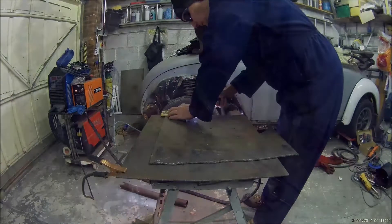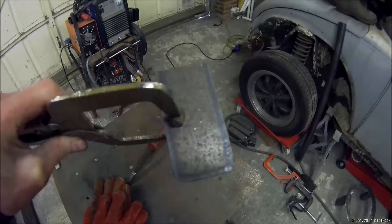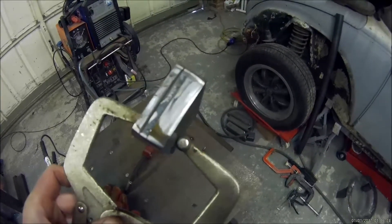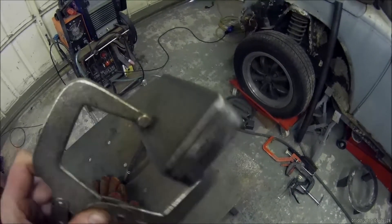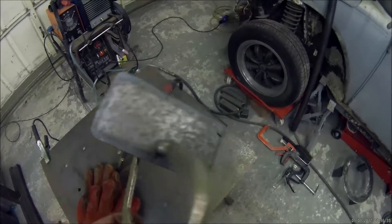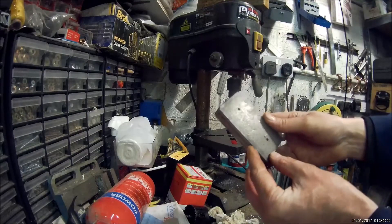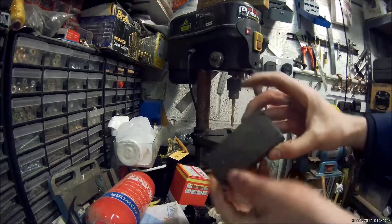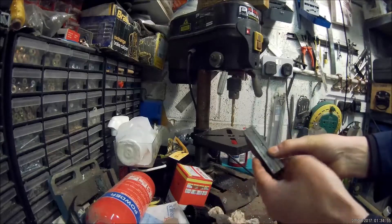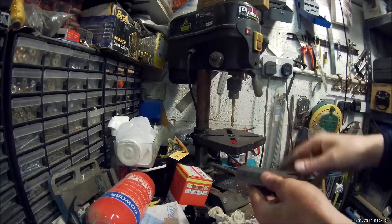I'll just tidy up there by using the plasma cutter to cut offcuts from the engine mounting plate and just clamp those four pieces together. I'm going to put a couple of tack welds on them to hold them as a sort of one piece, then mark one end out and drill all four at the same time to make sure all the holes are in line, then just break them apart again and grind the welds off. These are the plates I'm making to mount the casters — tack welded together front and back, marked out and pilot drilled. I'm going to open these out in two stages to 12mm for the bolts that are going through them. Doing it this way ensures all four plates are perfectly aligned.